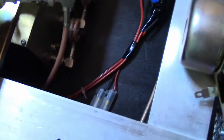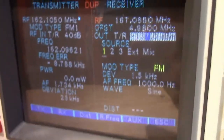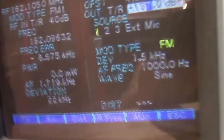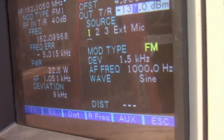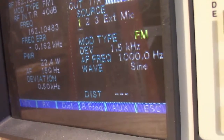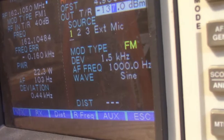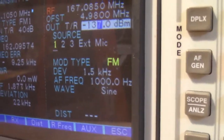Let's move to the transmitter. This is the coaxial cable leading straight to the back of the transmitter, and we're going to test the output of that transmitter's functions. Over here in the transmitter section of the IFR, we're just looking for the basic stuff. It's got 22 watts of output, we're off frequency by 150 cycles or so, and it's got good deviation. That's looking good — 22 watts. So the transmitter is working fine.